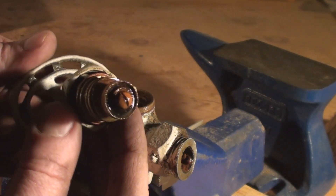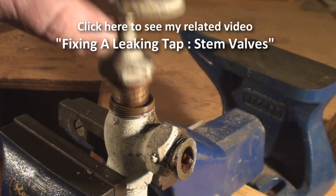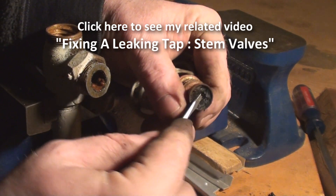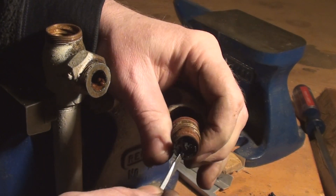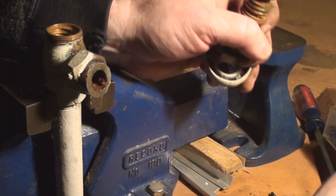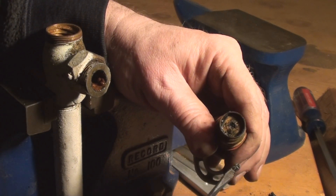There you go — stem valve, just like the ones in my earlier video. We'll just change the bushing on that real quick and I can put those back in service. Here's what a really bad looking valve bushing looks like: it's completely dried out and it's going to take quite a bit of digging to remove it. Take it apart, clean it out, put in a new bushing and reuse it. A new valve like this is about $7–$8 Canadian; one of these valve bushings is only a few cents.